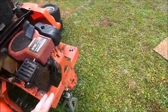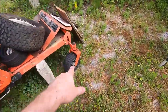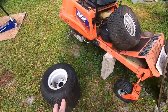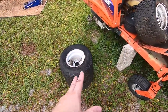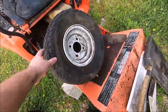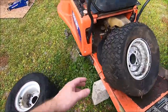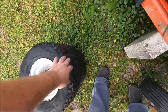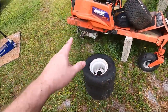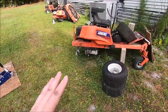This had all kinds of flat tire problems. So this front one's flat. We're going to do something with that, and we pulled these three off. We're going to pick the best two and put tubes in them, because obviously the tires are a little worn, but tires are pretty expensive. Once you get air and tubes in them, they'll hold up — they have good tread on them yet, for turf tires. So we'll put tubes on them and put them on this mower so we can move it around, and then the next step will be to get it running.